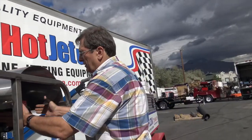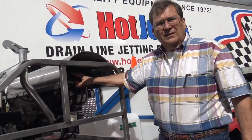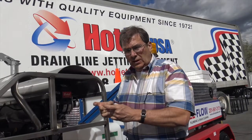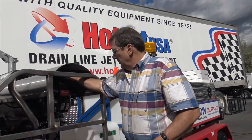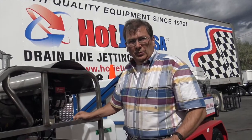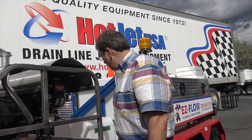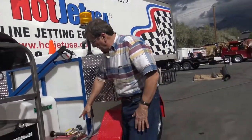So rarely do we need to get up into service on this. And I recommend somebody know what they're doing, because you've got some really high voltage that ignites the diesel fuel, okay? It's got like 2 spark plugs in there. And you know, a lot of guys are really familiar with oil burners. The same oil burners they've got in the Northeast at the homes there. Okay, as we walk around, let's show these valves.